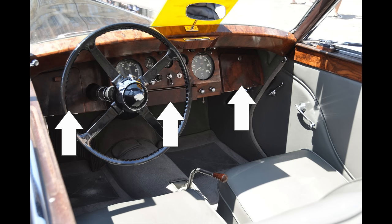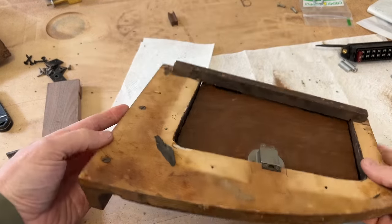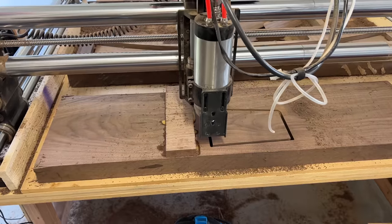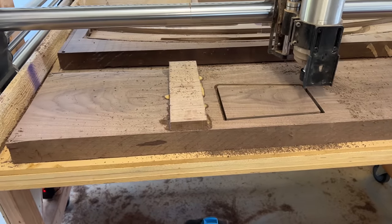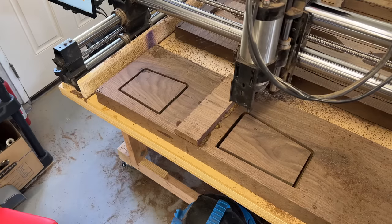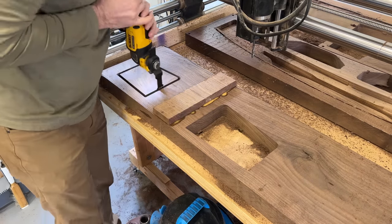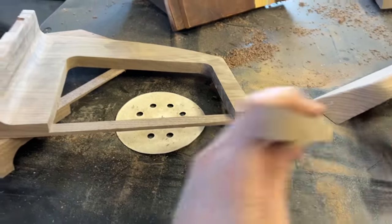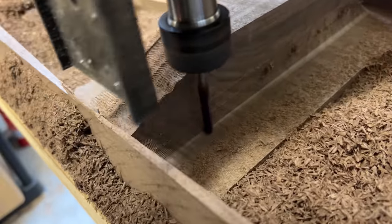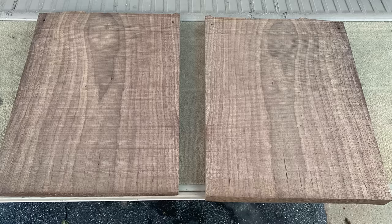This car originally had three glove boxes — because, and this is true, people in 1950 England had six hands. I have two, so I'm leaving out the middle one but keeping the outer two. These were originally made with multiple pieces of wood glued and nailed together. The whole thing is slightly taller than my large piece of walnut, so I glued some extra walnut on top in a couple of places. I didn't wait the full 24 hours for the glue to set because I like to live dangerously. I cut the opening first, leaving tabs so the last cut wouldn't cause the piece to jump and break my tool. I had a friend bandsaw my last bit of walnut in half to make the glove box doors.